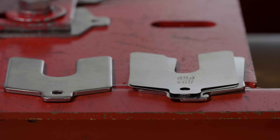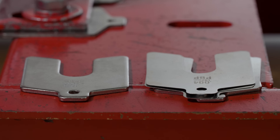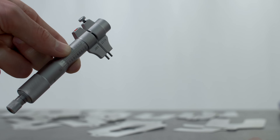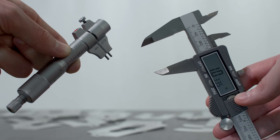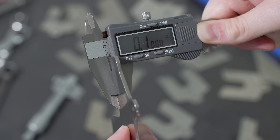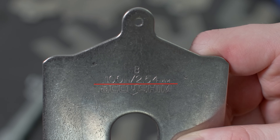Remember to minimize the number of shims you use. It's always better to consolidate with thicker, fewer shims. Lastly, measure the thickness of shims with a micrometer or caliper. Even small amounts of error on shim thickness can be compounded, causing errors. Measure to be sure that the labeling on a shim can be trusted.